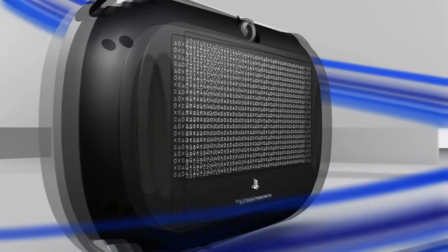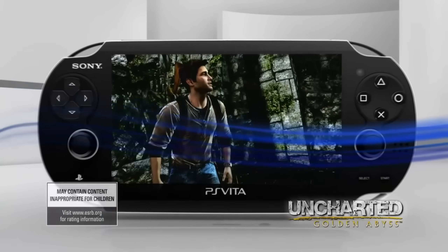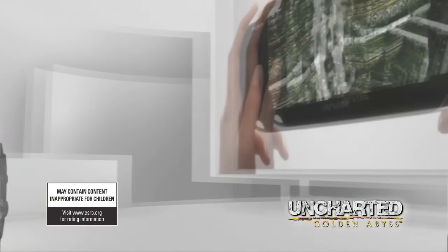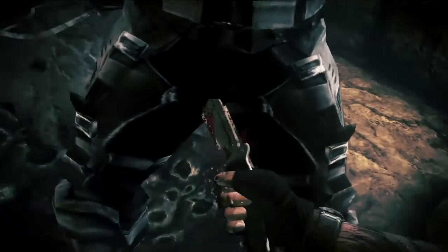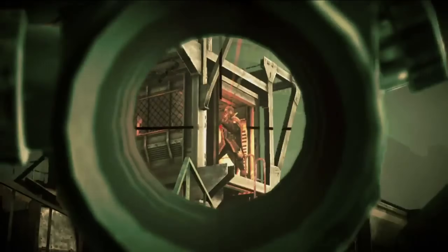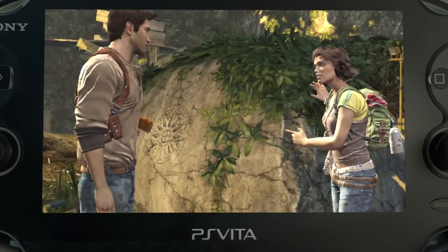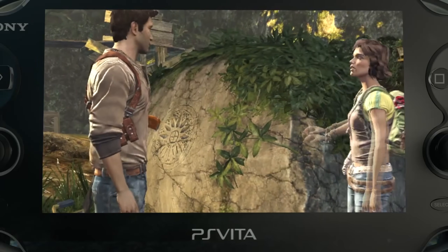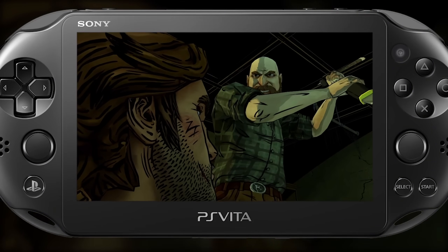In the end, the PlayStation Vita's hardware was a bold blend of mobile efficiency and console ambition. Its quad-core CPU with clock scaling and its PowerVR GPU with programmable USSE2 vector cores made it a technically impressive device. Developers who understood the system were able to unlock console-grade visuals in a handheld format, and it makes me hopeful that maybe Sony gets back in the mobile space. With rumors of a next-generation PlayStation Portable possibly coming out in the future, I can't help but be a little bit excited.